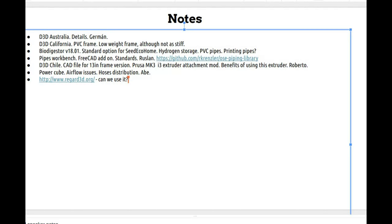Yeah. And can you control the thickness of the plastic which comes out of the nozzle? To a limited extent. We don't do that, but if you go slower and push harder on the filament, more of it is going to come out, so you can get slight thickness variation. There's a whole science to that, more extensive than what we can cover right now. It's not trivial. But basically you let it come out at a somewhat fixed rate. There are all kinds of tricks you can play, like withdrawing the filament and then pushing it back out. There's some control, but it's a complex topic.